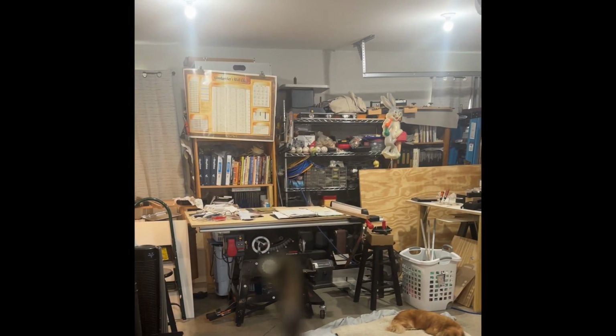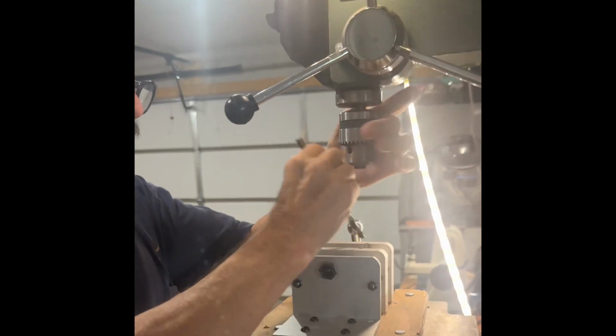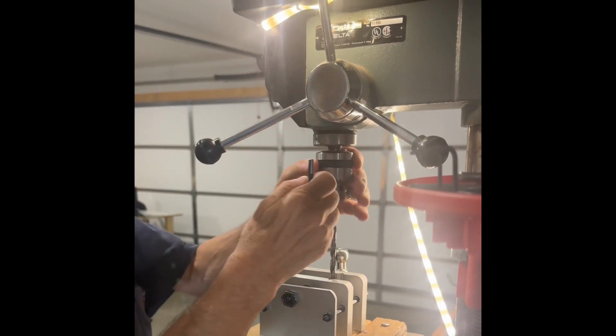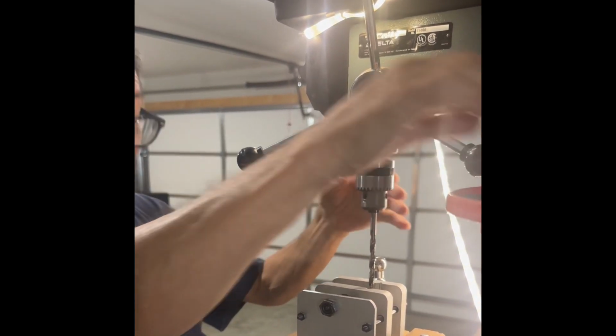So this takes 7mm tubes, and I have a drill here, and it's a 7mm drill. And I like the ones that have little tips on the end. I don't know if you can see that or not, but it's a little pointed end. The lighting in here is bad. Anyway, it's pointed. It's a nice little sharp tip to go right dead center. Lock it in place. No, we don't want anything slipping inside.